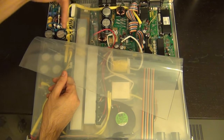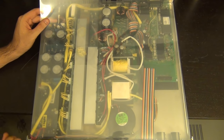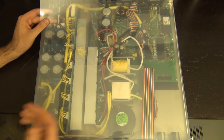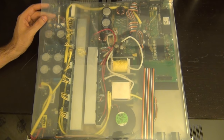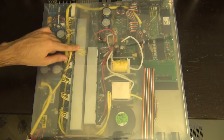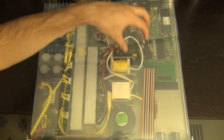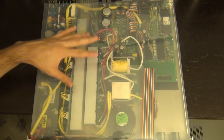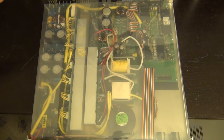The individual sections of the power supply are quite recognizable — separated into the main input, the main output, and digital circuitry in three segments. There are lots of low-profile transformers, as expected from a switching power supply like this. It obviously steps up the voltage quite a bit because it has to reach 600 volts, working from 110 volts here in the US. The plastic is all glued down — not the most elegant solution; I'd have preferred hard plastic with pegs and screws.